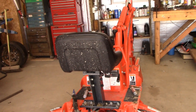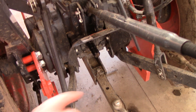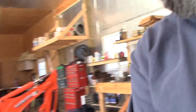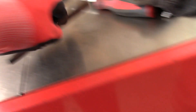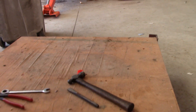I got a couple little tips that are going to help make this job a little easier, taking it off and putting it back on. The first thing we got to do is take off the three-point. You're not going to need too much — you're going to need a pair of side cuts, a 14-millimeter wrench, a cold chisel, and a hammer. I like to have something to sit on because I'm an old retired mechanic and my knees kill me, so I try to work whenever I can sit down.